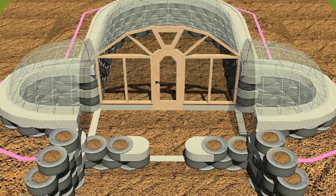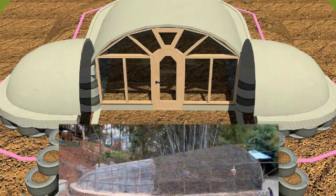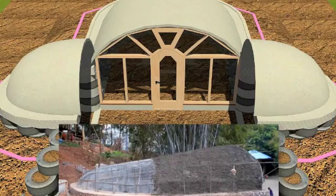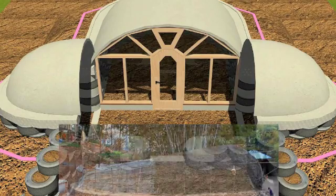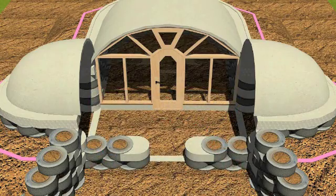The vaults are then plastered. The first coat of plaster usually has some fiber in it so it doesn't go through the mesh inserted underneath the rebar. Three or four coats of plaster give us a ferro cement dome that is very safe and very lightweight.